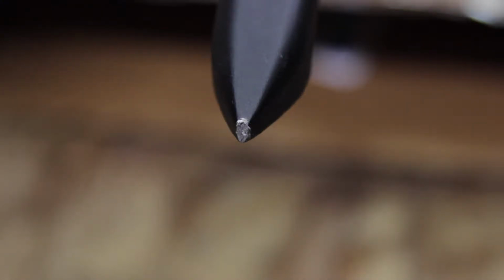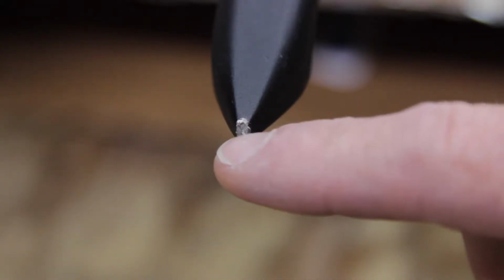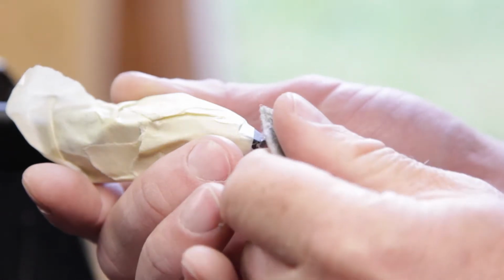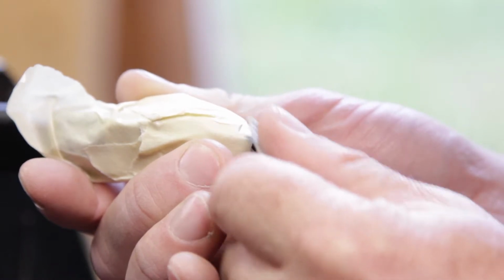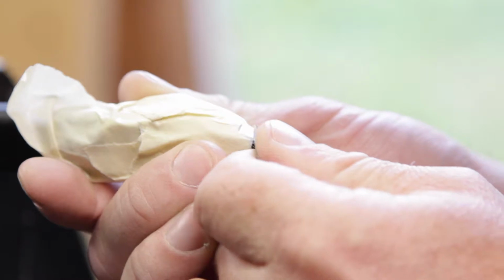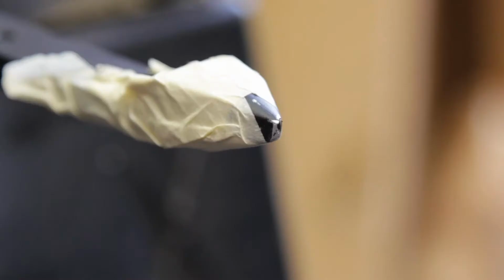also some manufacturing defects. This one, just the end is down, got banged in, and the box was pretty thrashed. There are some pretty big lips here from the aluminum smashing into what looks like concrete. So I'm just taking down these edges a little bit to make it a little flush before I put on the JB weld to finish off the point.